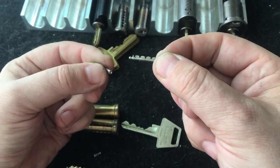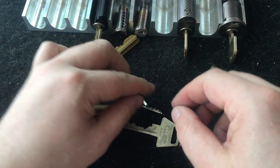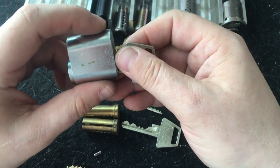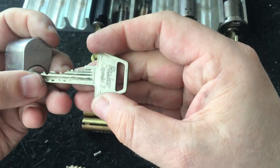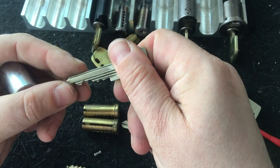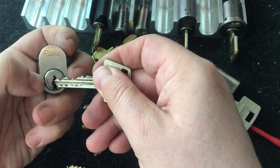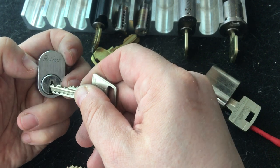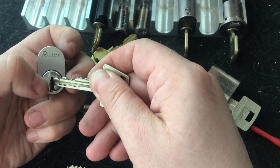We had this for a long time - the Garant 10 and the Combi 1100. They also made locksmith-specific versions: the Combi 2 and Combi 900, which are just different sales names for basically the same Combi. As we can see, they come with a huge variety of restricted profiles. Some even make use of a profile tree, so you can have one keyway and more open keyways that fit multiple keys, expanding the system by using different profiles and different levels of warding in the plug.